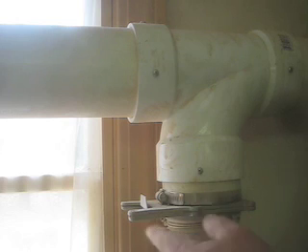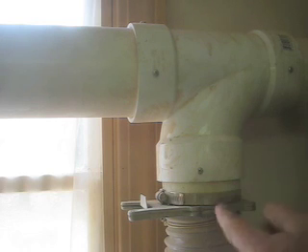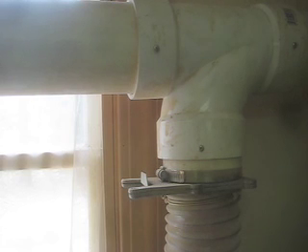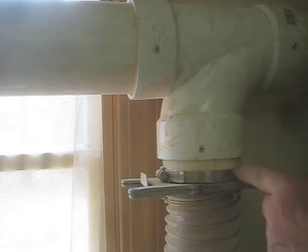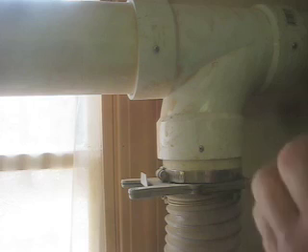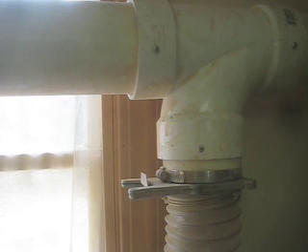I also have these gates that are too small to go in here, so what I do is cut a piece of pipe and put the gate in the pipe — but the gate flange is still about an eighth of an inch too small. So I put a steel band clamp around it, heat the band clamp up with a propane torch, and as you heat it, the heat carries around the stainless steel clamp. You take a screwdriver and give it a half turn every once in a while. You've got to be careful not to damage the PVC — I do have a couple of scorched pieces.